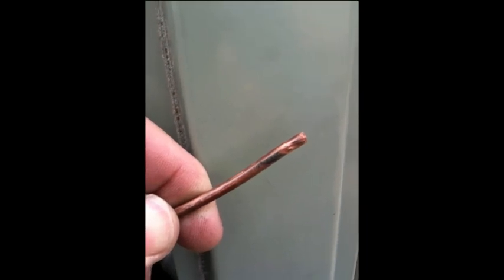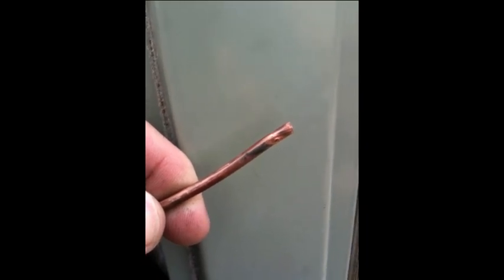We're looking at the Rheem unit again for the second time. I replaced the compressor yesterday, and if you notice, this is one of the feeder tubes — the small capillary tubes — and there's a small hole right there where my finger is pointing. What had happened is these are bunched together in the unit and this rubbed against another feeder tube causing a small hole in it. That's what my freon leak was. I had repaired another leak like this about two months ago on a different feeder tube.